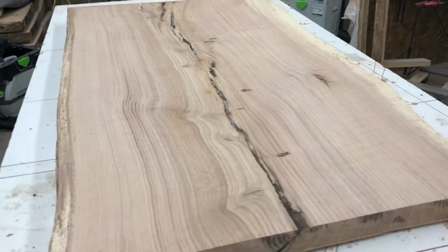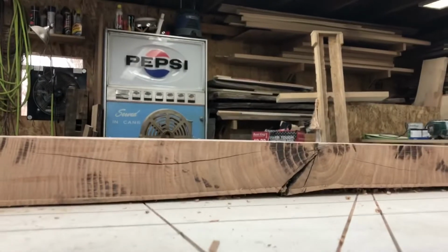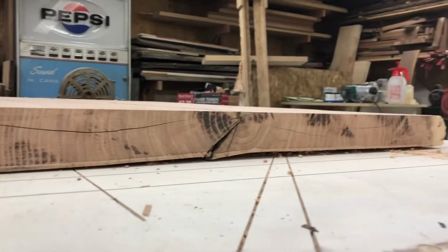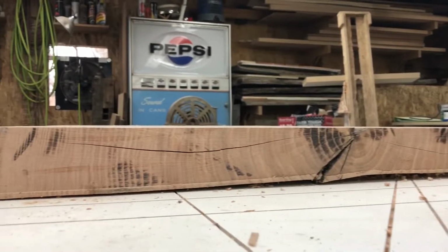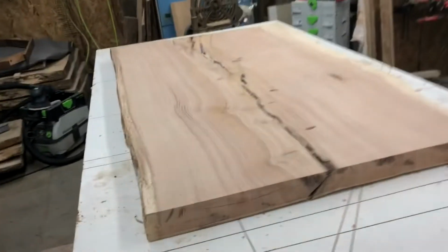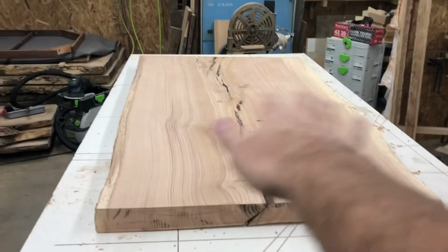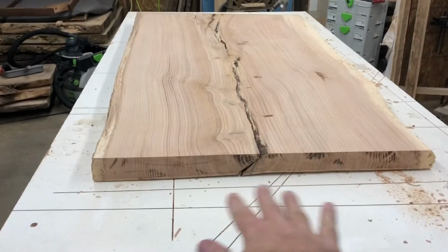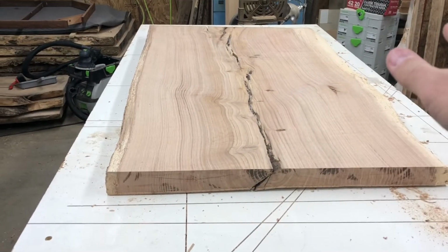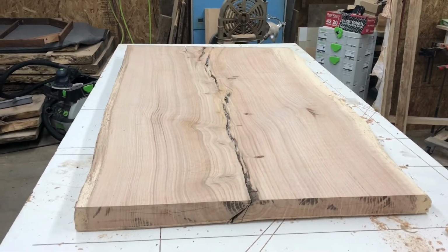So that'll probably be the next steps. Keep following along. All right, so the A side is all the way flat, all the way parallel. Now that side is done, in the sense that I'm not going to do any more flattening to it. So now we flip it over, and that super flat side will face the super flat workbench, and then I router plane the back. That's what gives me my two coplanar sides.